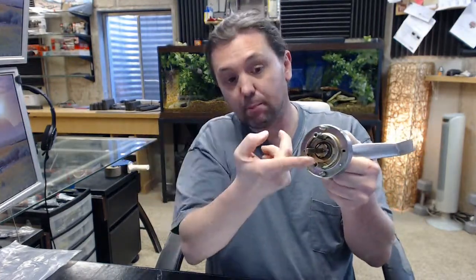You might have to get in there and file that down, because some exit devices take a male part shaped like a plus sign that goes into a female part shaped the same way. I've encountered field situations where I've had to file this down on both sides equally to get it to fit in. If you're in that scenario, absolutely file no more off than you need — you don't want that tailpiece to be any shorter than necessary, because you want it to begin rotating as soon as the lever rotates and properly retract the latch bolt all the way in.